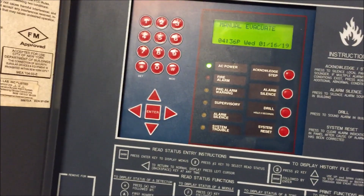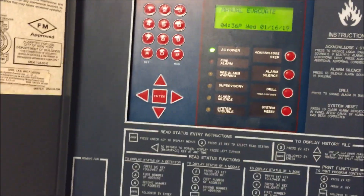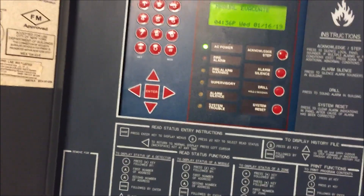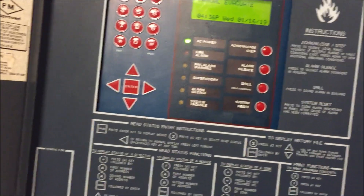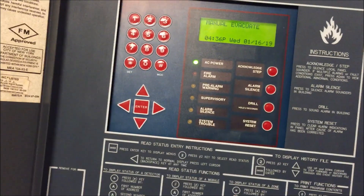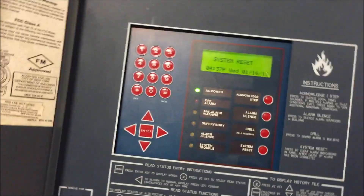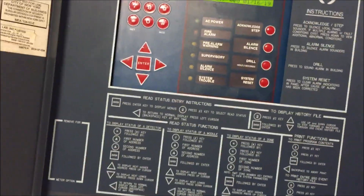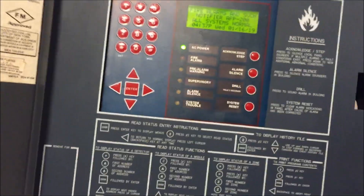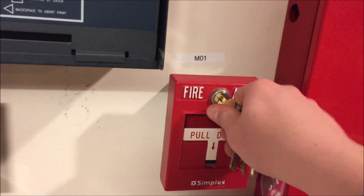Oh, I forgot it does that thing — if anyone can actually help me with this: when I go to do a manual evacuate, it won't run my strobe circuits, so the module is not being powered, which means the alarms aren't going to go off. Normally in an evacuation it would just sound the sounders, but it's not doing that apparently. So if you know why on a Notifier AFP-200 the strobe circuits won't come on in a fire drill, that would be swell — the manual for it kind of sucks. Anyway, thanks for watching and have a wonderful day.